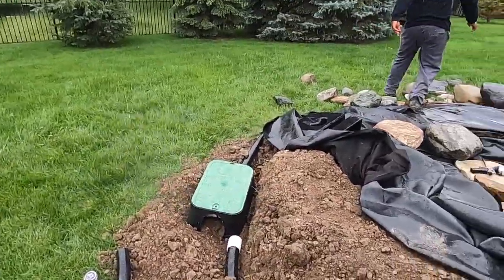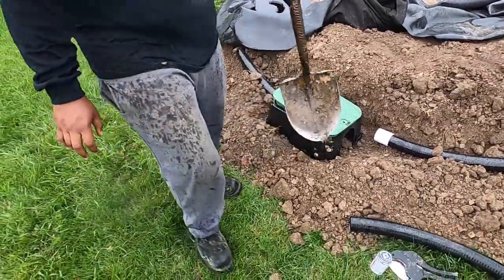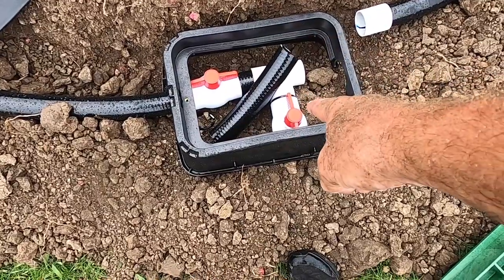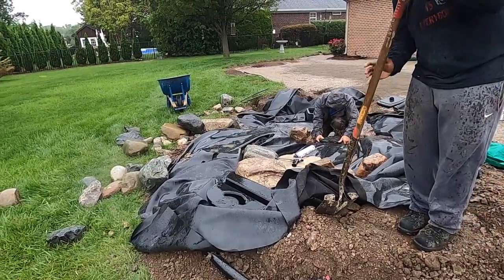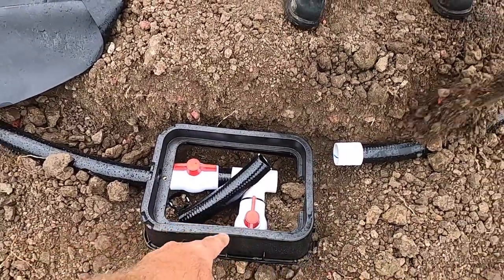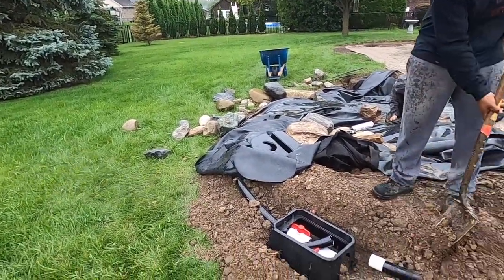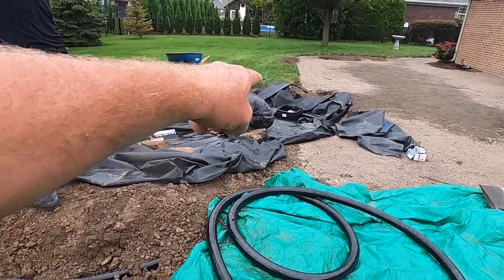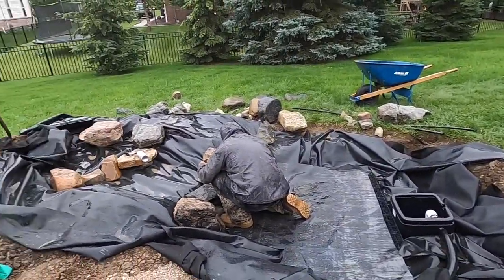Like we do on many of our features, we've got our line coming from our pump vault, buried here. This valve box — open it up — we've got a T. We've got another valve that's going to be discharged. This is the flow that goes up to our aquascape spillway box. But in the springtime, or in the event of a heavy rain, the customer's basin could overflow. As they see that water level coming up, they can open up this valve. From that valve, outside the landscape bed, will be a pipe that discharges water out. In the spring it's crucial because that water stinks — you want to change out your water in the springtime on a pondless waterfall. You've already got the pump in place, now you've got the valve. Easy peasy.